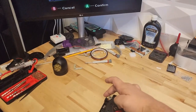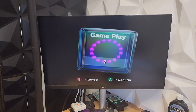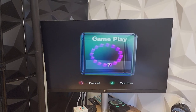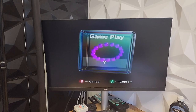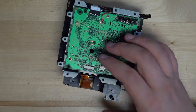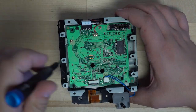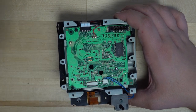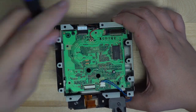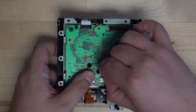Today we're going to be recapping a GameCube's disk drive. Here we have a GameCube that has a fully refurbished disk drive with everything besides recapping. Notice that the console still doesn't read the disk. When it comes this far, where we've already reflowed the potentiometer, set it down to zero, and also replaced the laser — at this point, we know the caps are bad for sure. So we'll go ahead and swap the caps out on this board to make the console read disks again.